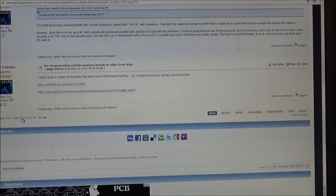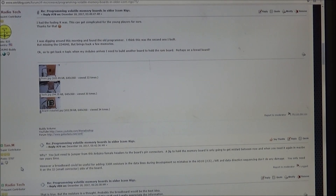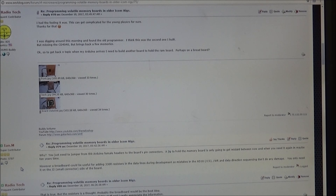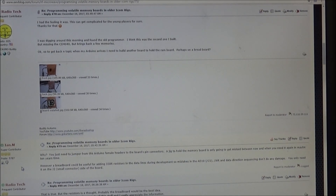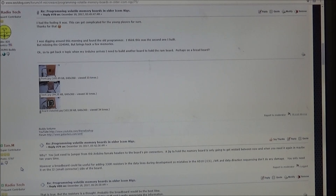CJ just posted today that he's been out with the flu, so we hope he gets feeling better and can get back in the swing of things — that flu is nasty. I know it's going around here also. I wanted to try using my old programmer, which is DOS-based — it's a Modular Circuit Technologies programmer — but that thing just will not do the algorithm needed to program this RAM module because of the voltage changes required.